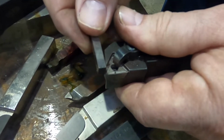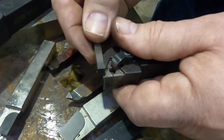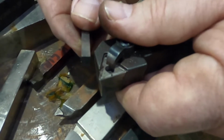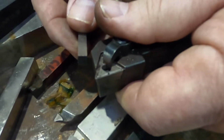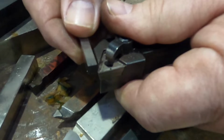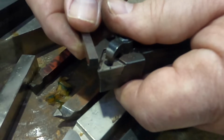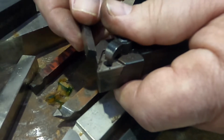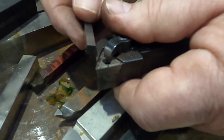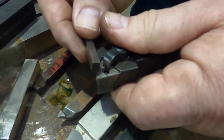Then also, of course, your end radius will make a difference as to how it reacts. A larger radius will, if everything is secure, no movement, make a prettier finish. It will last longer. It also means you're not dead square up into the shoulder where you're cutting a shoulder on something. You're going to have whatever the radius is away from there. So in certain situations, you want a large radius. It's clearance for a bearing. You want the strength that a radius on a shaft gives. In other cases, you want a small radius.